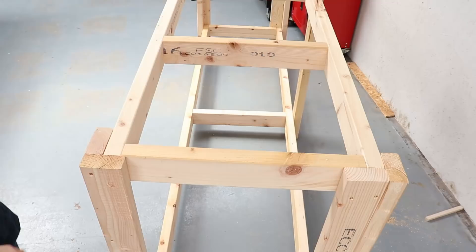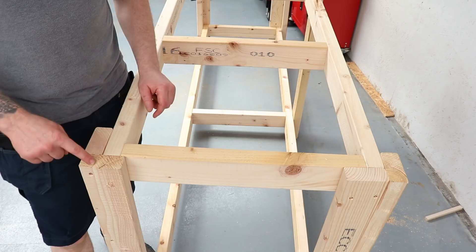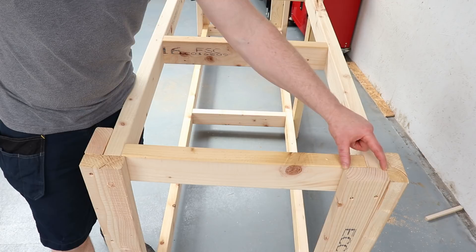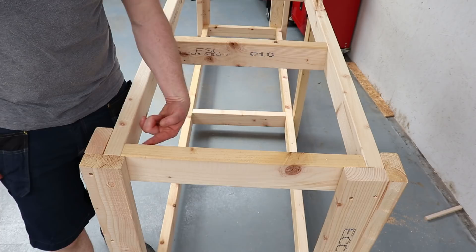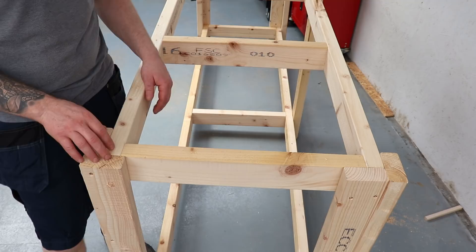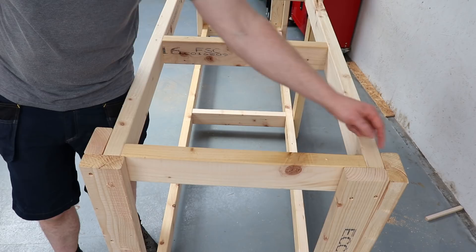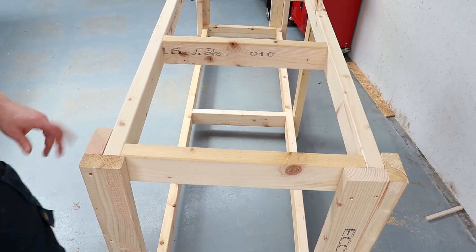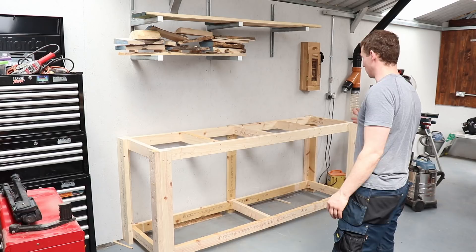Here's where the mistake is. This one is correct, this one is incorrect - not detrimental but bad practice. The L-shape has a long side and a short side. My long side is catching both boards on one end, but on the other end the long side is only catching one board, so my stretcher is barely caught. I drove a couple of angled screws to catch the lot - it's good and strong - but the front legs should have been flipped around so the long side catches all your boards in the corner. Watch for that one.